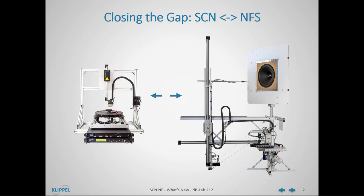The larger NFS enables acoustic holographic measurements of loudspeaker systems, as well as — shown here with the NFS baffle — of transducers. Due to its holographic measurement principle, it can simulate free field conditions in normal rooms and does not require an anechoic room. The NFS is quite suited for loudspeaker systems, as well as for larger transducers with the NFS baffle, as shown here for an 18-inch subwoofer transducer.